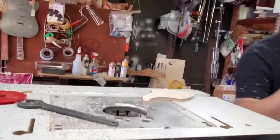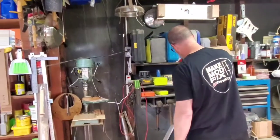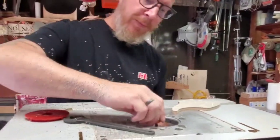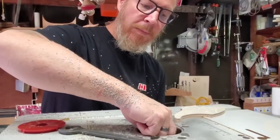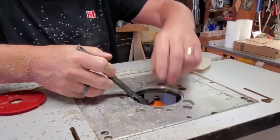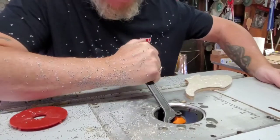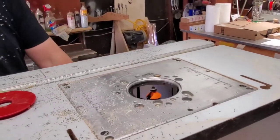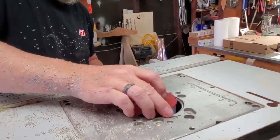So we're going to put the blank back and we're going to grab a 45-degree chamfer bit. Same thing — I'm going to lift the bit up a little bit from the locking nut. And we'll put this on maybe the next size up collar.